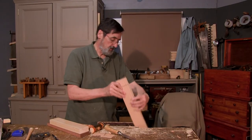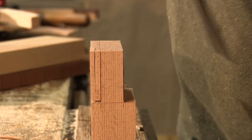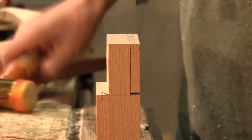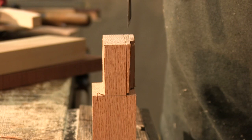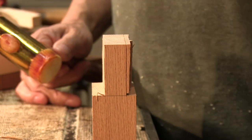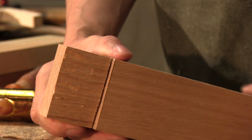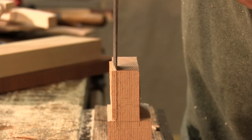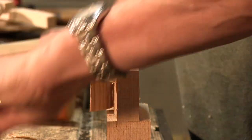That's how you split your tenon — it's much faster. Obviously, one side split straight and the other didn't. You go to the other side of your tenon, pop it, and that's working parallel. On the other side it was leaning out, so if I split again this could lean into the face of the tenon. I'm a little more reluctant, so I'll split this side here — you can see it's fairly parallel to the surface.